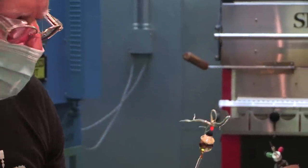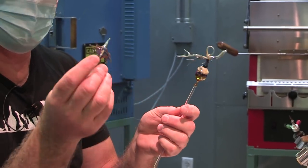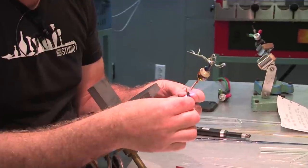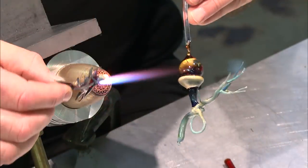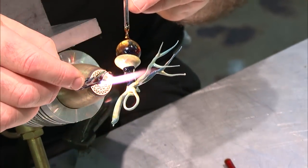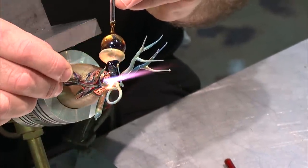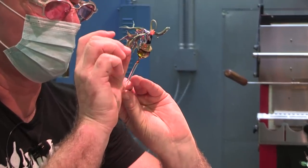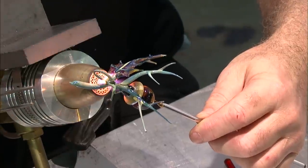I think that'll work. Again, using our super small flame, any of your leaves to begin with. Try to keep the majority of the leaf out of the structure. Introduce heat gradually and gently. And you're going to put them in a triangular shape around. So again, more heat here. Attach, ensure that they're fused correctly. And you do have about 3 seconds to position them. Come back in and ensure that they're fused.